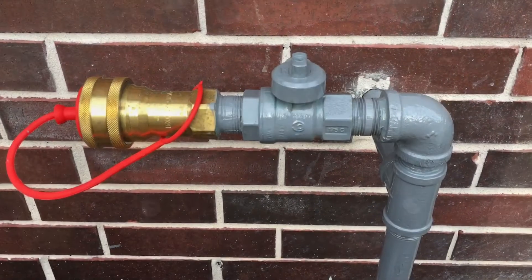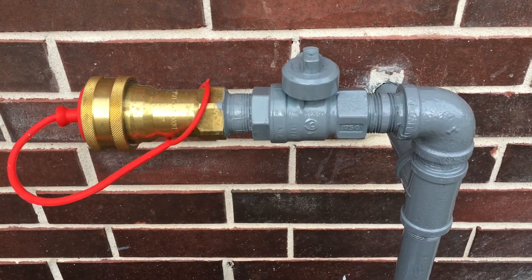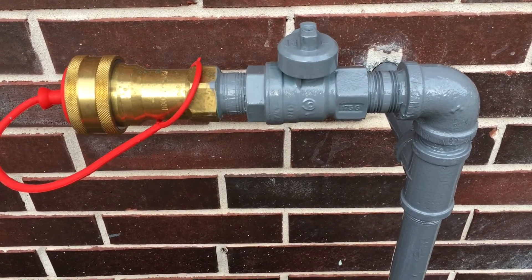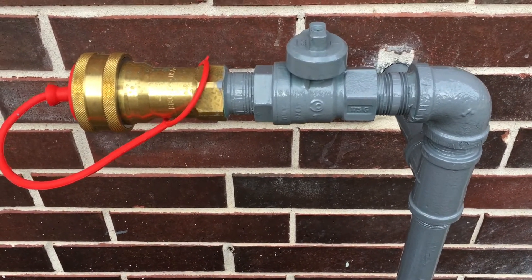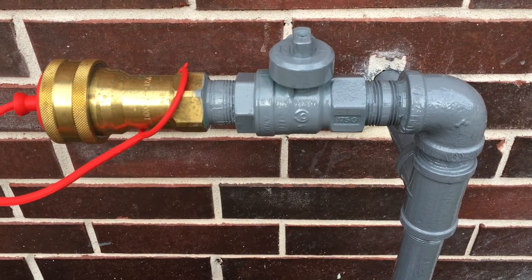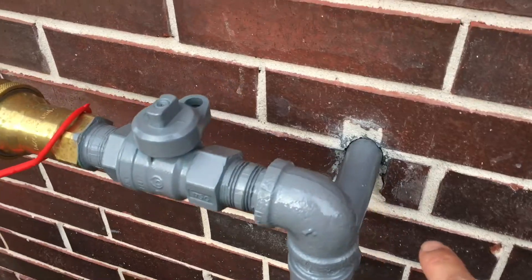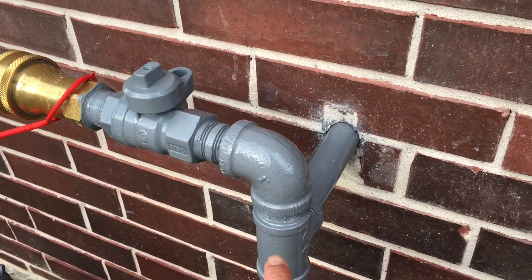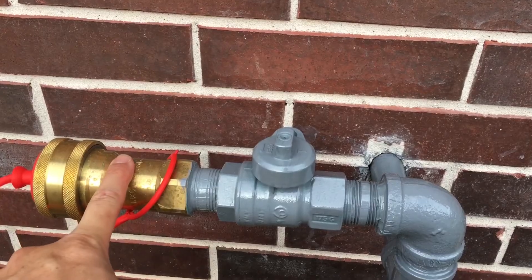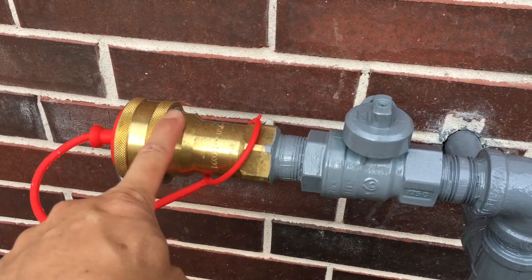Now off to the meter. Now we're at the meter, and that's why it's important to know what pressure your gas meter puts out. In my case, it was 4 ounces, also known as 7 inch water column. If your pressure is higher, you would need a new regulator. Here at the meter, I had a plumber come in and put in a T right here, and they also installed this gas shutoff valve for me. And this is the 1 inch quick connect that came from AB3 Power that came with the hose.